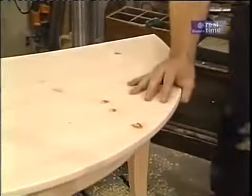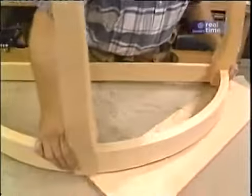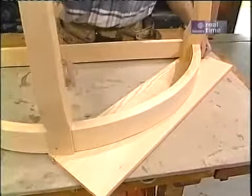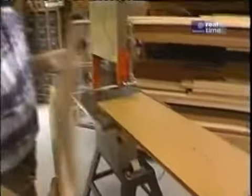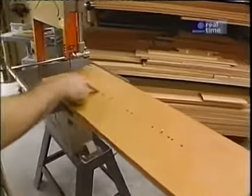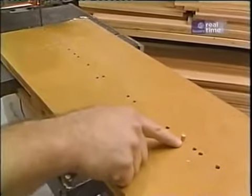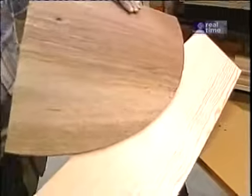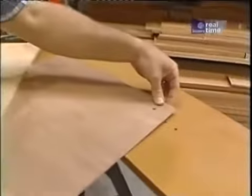Let's take a quick look at the prototype. There is a molded piece that's attached to the bottom of the rail. Now before I glue anything up, I want to form that piece. I suppose I could just take the rail and trace the outline, cut it freehand on the bandsaw, and then trim the ends. But there's a much more accurate way to make the cut — that's using a circle cutter attachment for my bandsaw. You see a series of holes along a line that is perpendicular and straight off the axis of the blade. Every hole represents the radius of the circle to be cut. Taking a piece of scrap plywood and nailing it to the bottom of the blank, I can now place it over the radius pin and make the first cut.